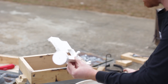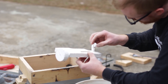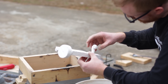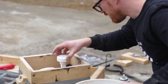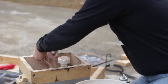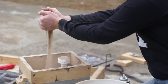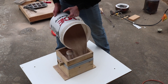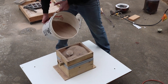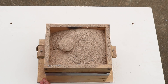After the unfortunate collision between the pattern and the flask side, I used a little bit of spray adhesive to repair the pattern. I put it back down in the flask very gently, and then I just sprinkled a little bit of sand around it so as to not disturb that compromised portion of the pattern. That pattern was just fine. The metal flowed right through that little feeder from the main sprue just fine, so I was really glad I didn't have to completely remake that pattern.